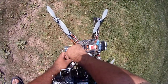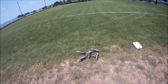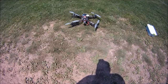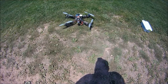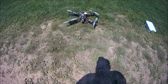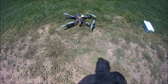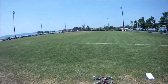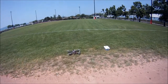I'm going to plug everything in and wait for the aircraft to acquire the satellites. Right now the aircraft is in GPS mode — it's giving me a green light and a red light. The red light means it hasn't acquired the satellites yet, so it's not safe to fly and you can't count on position hold. Once the red light stops blinking and the green light blinks by itself, that means it acquired the satellites. It takes about 30 seconds. When the green light blinks repeatedly, it has acquired the satellites and recorded the home lock position.